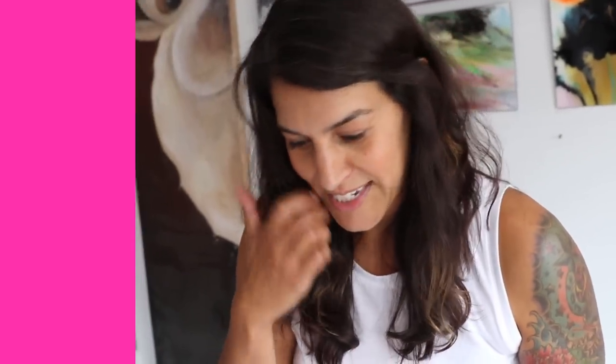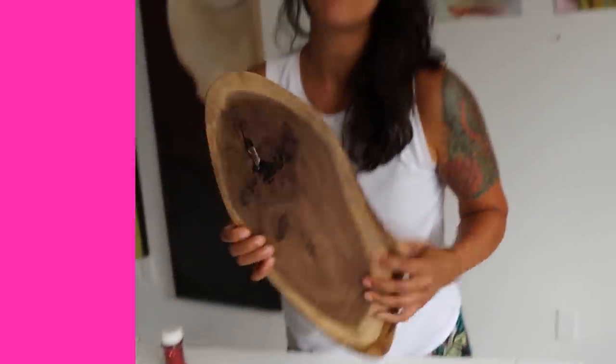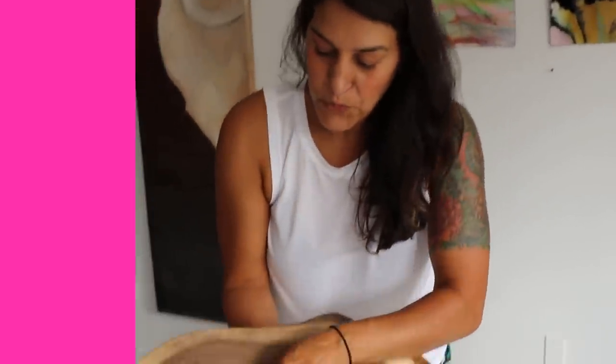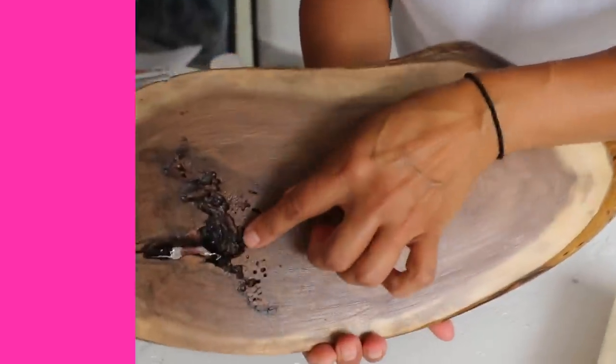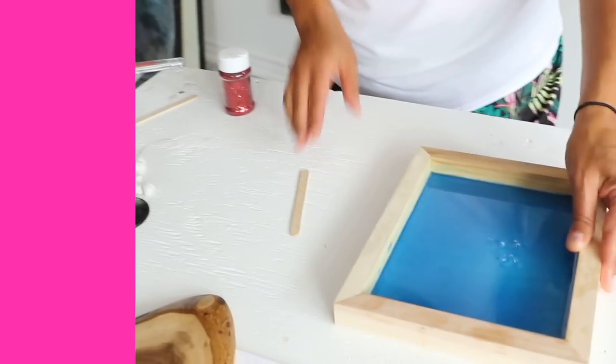With this method, because it's tacky, that's providing the tooth — I don't need to sand it, and in fact I couldn't sand it because it's too sticky. One instance when the three-to-five hour method would be a good choice is for something like this wood board that has a hole requiring six or seven layers of resin. That's going to take you six or seven days using the 24-hour method, so pouring every three to five hours would be perfect on a project like this.